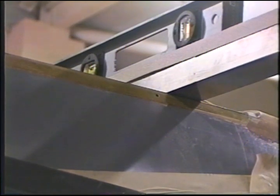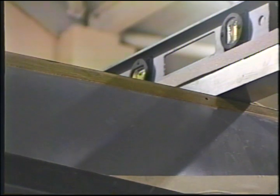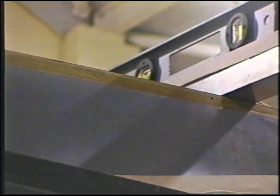Now the ones that we just did here, that one, and the other one, and 26. You'll measure down from above, up there on the longeron, and in that area, and in that area, and you will reproduce the bottom curvature of the two Strakes precisely, and of course the bottom of the spar as you get them. And again, in this front area, from there, the center line projected 6 inches, producing a level water line on the leading edge. Next step, epoxy.